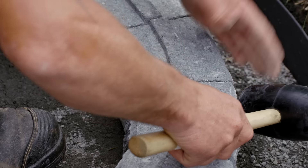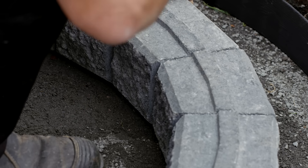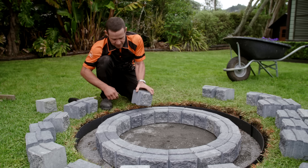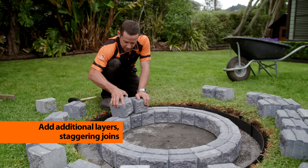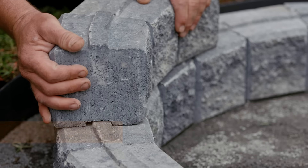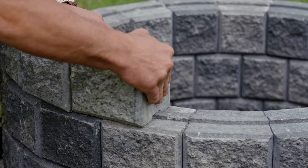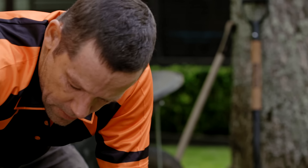We're just about ready to put our second layer in. Once we've got this first layer sorted, we're home sailing. When you start laying your second ring, you want to make sure that you stagger the join — start the next block right in the middle of the last one. They just sit all nice together like that. Work your way around and build it up four layers high, using your rubber mallet to tap the blocks into position as you go to ensure a tight, sturdy fit.